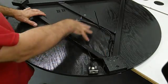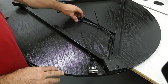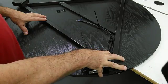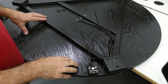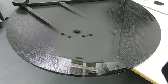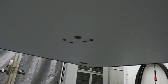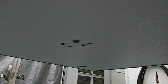I've run my wire, put some zip tie holders down, my zip ties in, nuts and washers on my legs, and tightened them down. Take note of how I run this wire — I put it very close to the foot so this minimizes any chance of the wire getting pinched when you set up the scope. Now we'll flip the ground board over and get the rocker going. Before we put the rocker on the ground board, I want to show you the underneath. You can see the big center bushing — that will be the center bolt to go through the rocker into the ground board. The four smaller ones are for the contacts of the power ground board system.